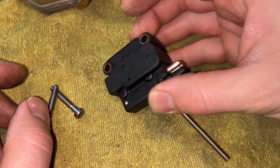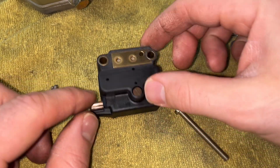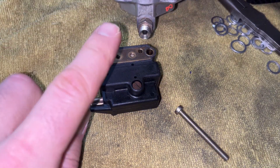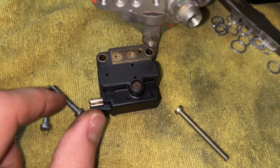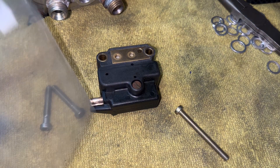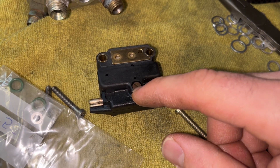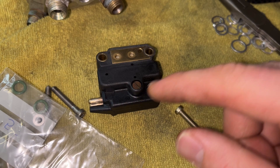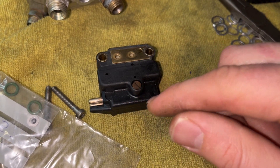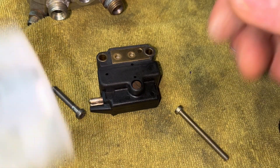Now what we have here is the electro-hydraulic differential pressure sensor actuator — I'm not actually sure of the exact name. There are two O-rings that mount up here, the green ones, and also a little fine filter. The kit comes with a new crush washer and O-ring. Honestly I'm not going to mess with it further — there's a little adjustment screw in there and I do not have testing equipment to do this correctly. I'm concerned I wouldn't be able to reset it properly, so all I'm going to do is put the O-rings back on.